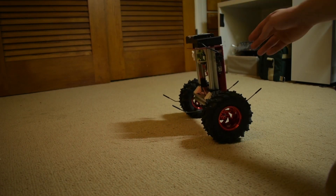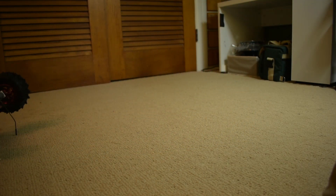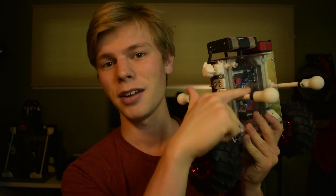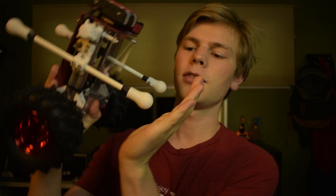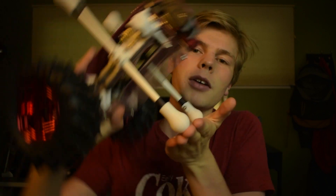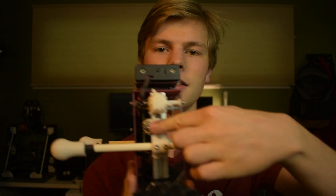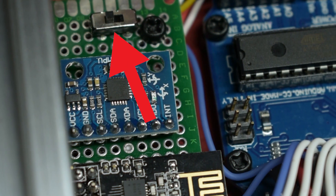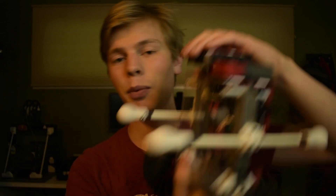I had to come up with a redesign where I actually upgraded to a plastic coat hanger, with round pieces to let the robot skid across the ground instead of becoming a pivot point for the robot to tip over on. I've also added a toggle switch for the motors, replacing the switch that used to be on the board, just to make it more convenient to turn the robot on and off. But now that the code is done and we have the rest of the mechanical assembly, let's see the robot finally working.